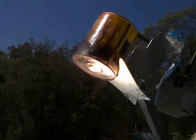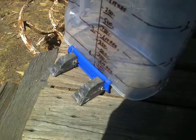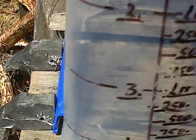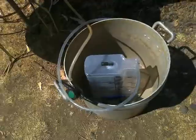Let's just hope the aviation gasket cement can handle it. A much neater gas connection is having its silastic cured. The 2 lead weights, which used to be wired to the 2-litre gasometer, augmented by a pair of shiny new ones, chiseled from the ancestral lead ingot. The water trap in the gasometer has been upgraded, and all that checks out and fits. So when the silastic cures and the hose is connected up, it'll have the same 1/2 pound per square inch pressure as the previous one did.